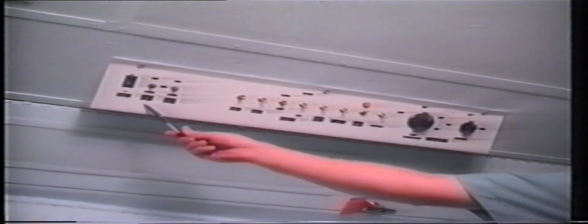Below the control stand is the vigilance acknowledge button. Below is the MU2A valve, which allows multiple unit brake control. Below is the emergency brake handle. Located above the driver is the overhead switch panel. The controls and switches located on this panel are described in detail in the operation manual.